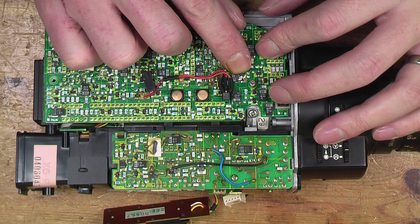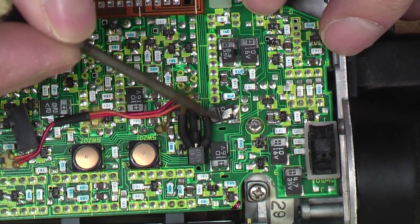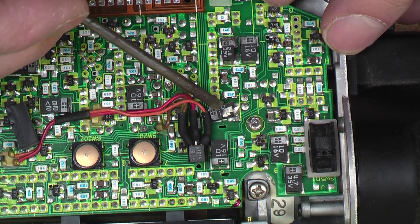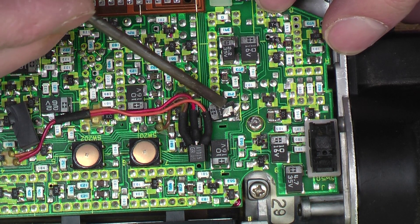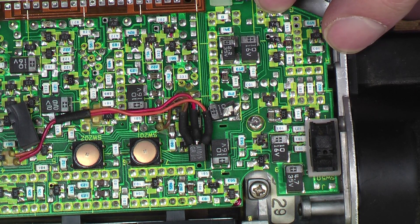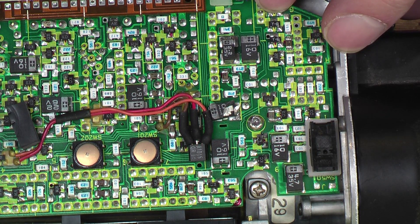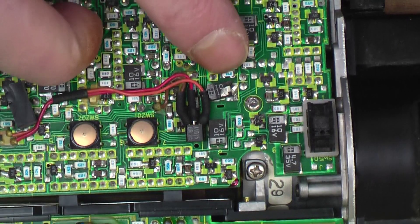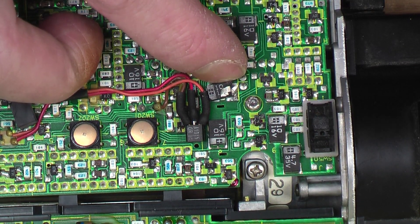What I've spotted is this — it's not looking very good health-wise. It's a surface mount tantalum chip capacitor that's blown its top off. I'm wondering if maybe power has been applied with reverse polarity at some point. Someone's obviously been inside this camera and tried to fix it. That would be the first thing to do anyway — replace this before I try turning it on.